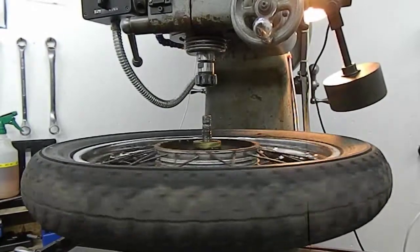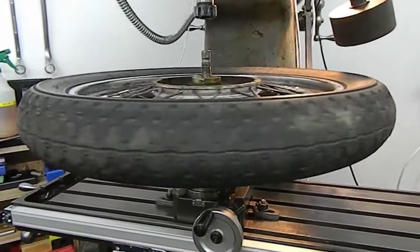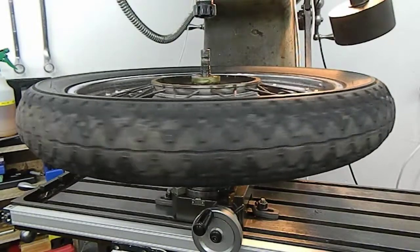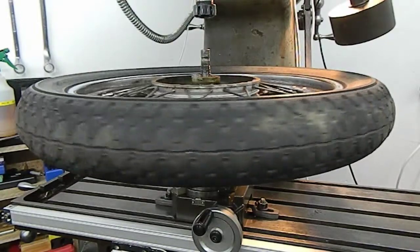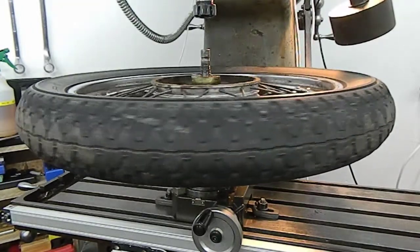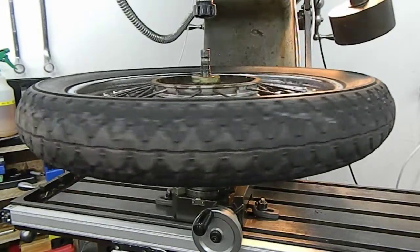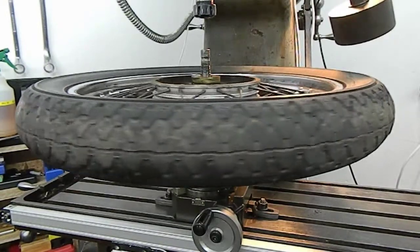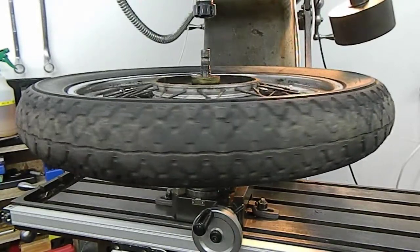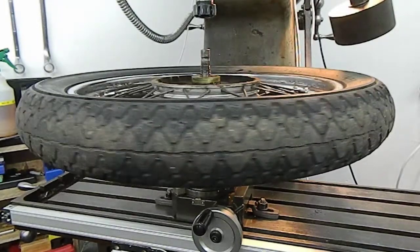And I've found from past experience, if you true them up on their own bearings, then you really can't go too wrong. It gives you a nice true wheel. I've seen people in the past skim hubs when the rims have been off and then lace them. That can tend to distort the brake drum again. This is a good method for old wheels like this where they're complete and you don't want to strip them.